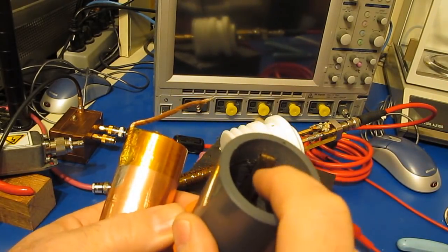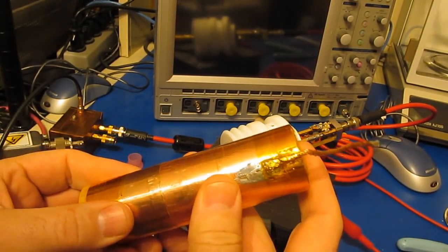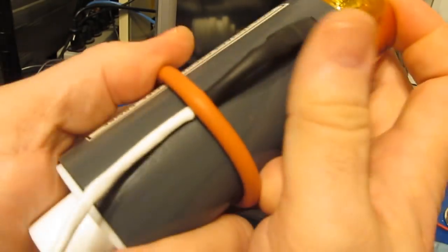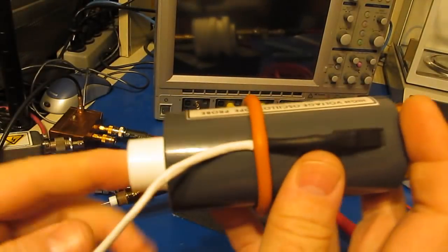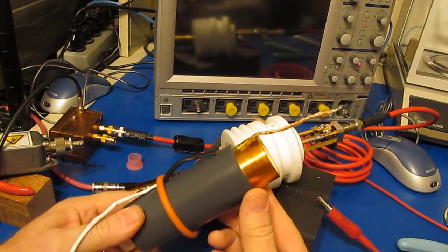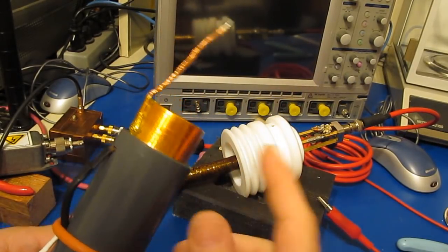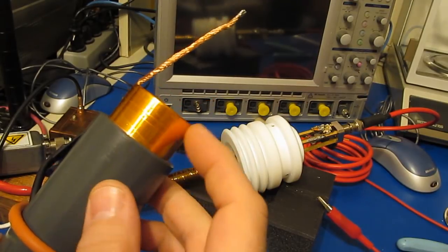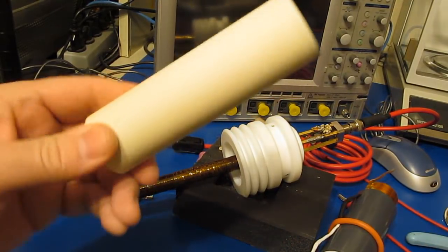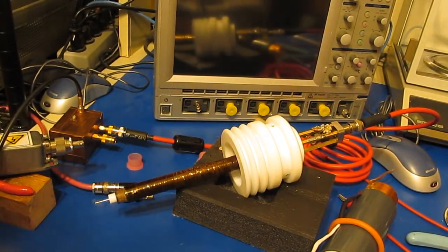You can see inside the tube - here's my brass ground strap, and this rides along this section of copper. This is actually copper foil that's been placed over a ceramic tube, then there's some Kapton tape that covers the ends of it, and this just slides inside like this. In the end here, this is a piece of Teflon, actually designed to fit down inside of the ceramic tube. When I took this thing all apart, one end up happening is I dropped the ceramic tube and it hit something on the table and cracked about an inch chunk out of the end of it. Of course that's not a standard piece you can just go to the hardware store and buy, so I ended up getting a couple of new ones made in case something ever happens again.